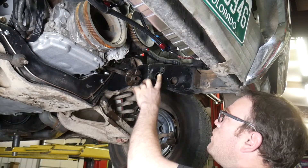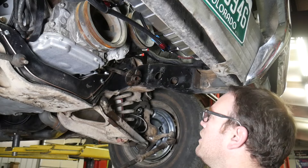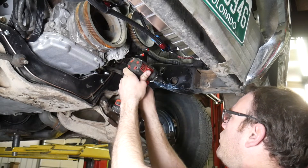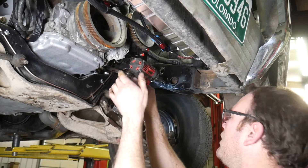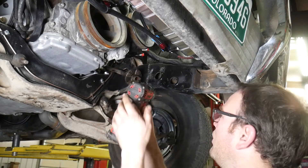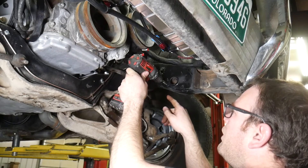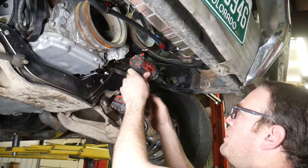I need to drill the three mounting holes out to 7/16. I'm just going to step it up. Looks like we're at just under 3/8 — I don't know what size those bolts were before, but this shouldn't take too long. We don't have to drill all the way through, but if you have a long enough drill bit, you can.